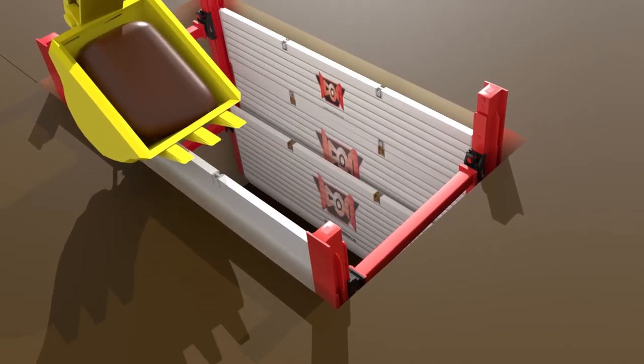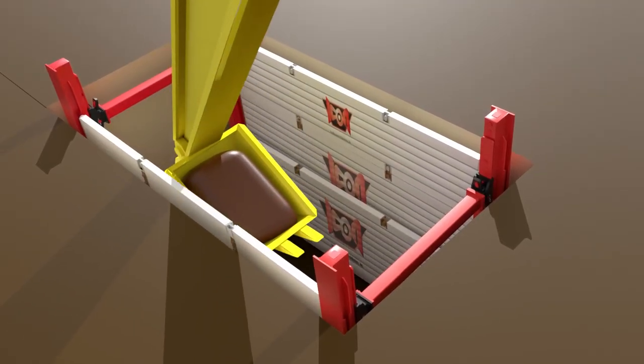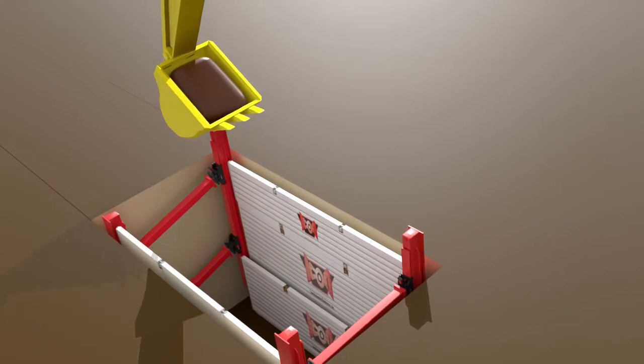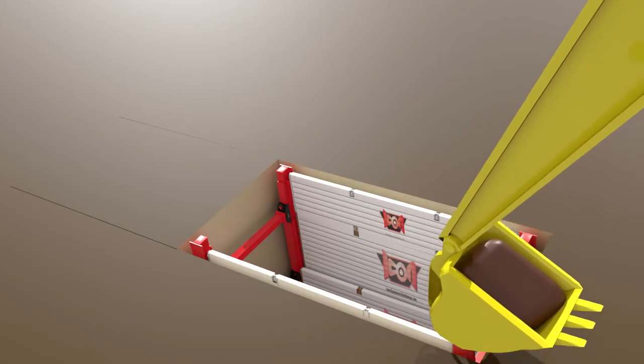At this point, all that is left is to continue digging and pushing the system to the desired depth, starting with the plates in the outside track, advancing to grade, and then advancing the plates on the inside track all the way to the final subgrade.